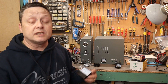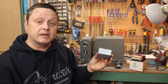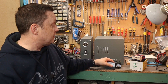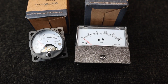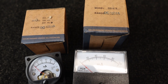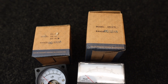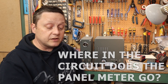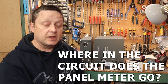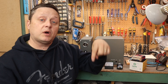You need to find something rated around 0 to 100 milliamps DC. This amplifier draws about 60 milliamps, so that's a perfect scale. I have two different ones here — a bigger one and a smaller one. Anything up to 100 milliamps is fine; 150 or 200 milliamps would still work too. The panel meter goes after the power supply unit, before it branches off to the left and right channel. I'll put a link to the revised schematic in the description below.